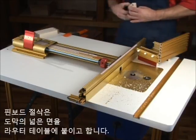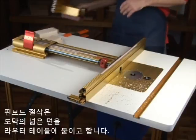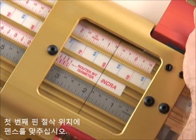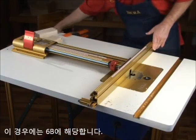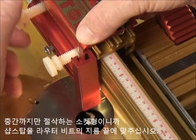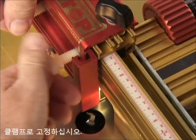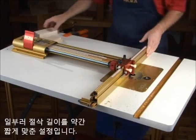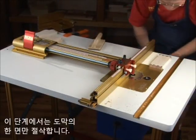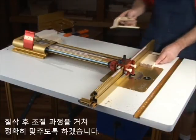The pin cuts are made with the stock face down on the router table. Move the LS to the first pin cut that positions the cutter outside the fence — 6B in this example. Since the pin sockets are stopped cuts, bring the shop stop just up to the outside diameter of the cutter and clamp in place. This stop setup will always produce a socket that is a little short, so we'll only cut one end of one piece at this time, then adjust as necessary.